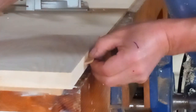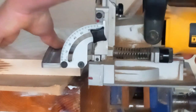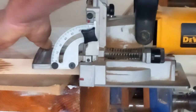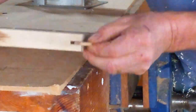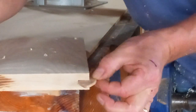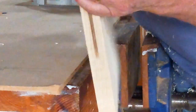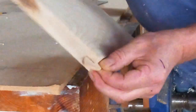To show the action in reality, we use that as a centre line, just to show you a sectional view. We do the same thing again — use that as centre and plunge the biscuit slot. The biscuit sits in there; you can see that it's gone in over halfway. It's nice and loose inside the slot. That's the centre point, and that's what happens in reality when we use a biscuit for jointing two or more boards together.